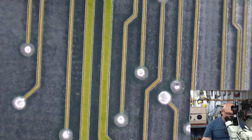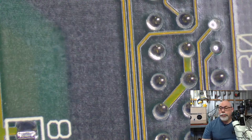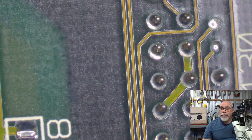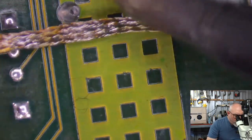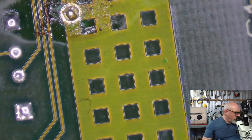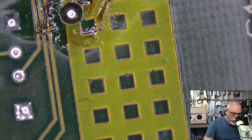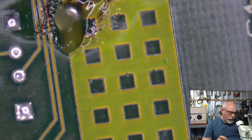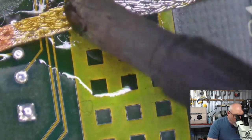The cases were very messy. But the majority of these computers all worked. Every one I tested has worked. Anyhow, in that batch of computers, I ended up with two 8500s, Power Macintosh 8500s. I think it was an 8500. And I really didn't need to. And Max was the person who actually tipped me off on these computers in the first place. He said, "Hey, is this anywhere near you?" And I said, "Yes." And so I thought I would give him an 8500 as a finder's fee. And I am very pleased to hear that it is working. It obviously has some RAM issues, but as did all of those Power Macintoshes at the time. And sometimes you just move the RAM around and it'll work.